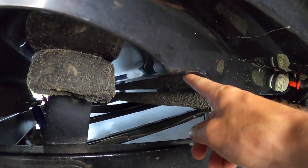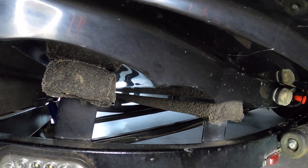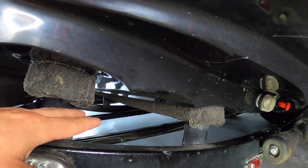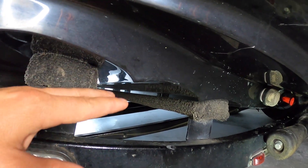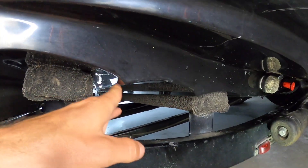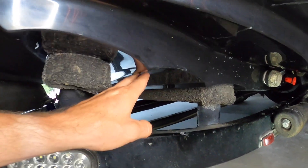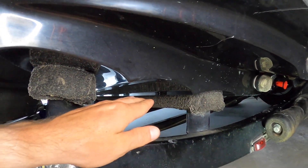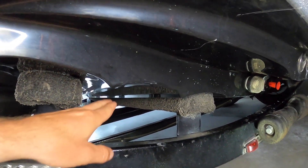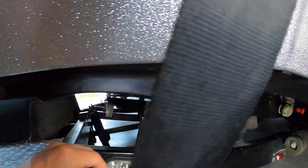Moving to the back of the boat, on the bottom you're going to have these ridges, and these are called strakes. I'm not a boat designer — there's actually a lot of engineering that goes into hulls, and over time different brands have taken bits and pieces and tweaked them. Essentially, strakes reduce the amount of surface area of the boat that's in contact with the water, which reduces friction and gets you better speed. They also improve handling — if you imagine a flat bottom jon boat with nothing on the bottom, it'll skid out when you turn. But add a ridge and it kind of acts like it's on rails, gripping the water better.